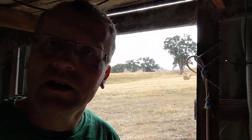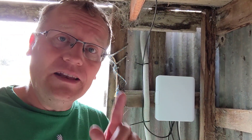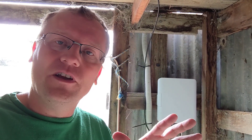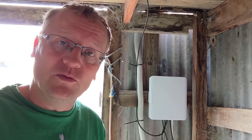Outdoor rated cable — very important, really important. I didn't use them for about a year, and one cable did fail recently. I couldn't figure out why I had an intermittent connection — on, off, on, off — and I thought it was the NanoStation, but it was just the cabling. So the lesson is: use outdoor rated cables, it's really important.